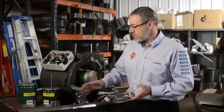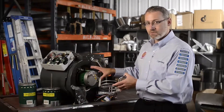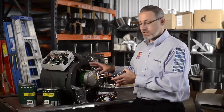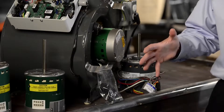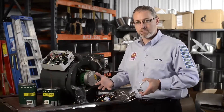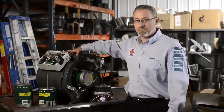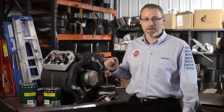To orient the motor in the motor mount, imagine how the motor is going to sit when it exists in the HVAC system. We want the connectors facing down, or between the four and eight o'clock position. That way, if any water gets on the motor shell or the motor harness, it rolls off instead of running into the electrical connections. Last but not least, industry best practices tell us to center the blower wheel in the housing and then tighten the hub bolt on the flat part of the shaft.